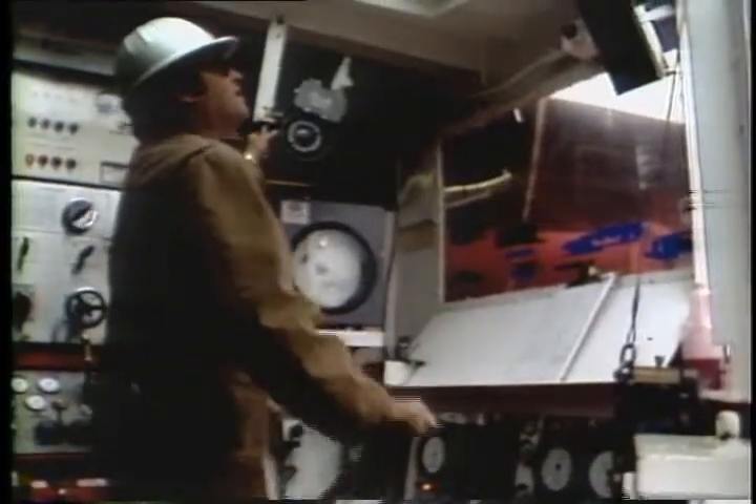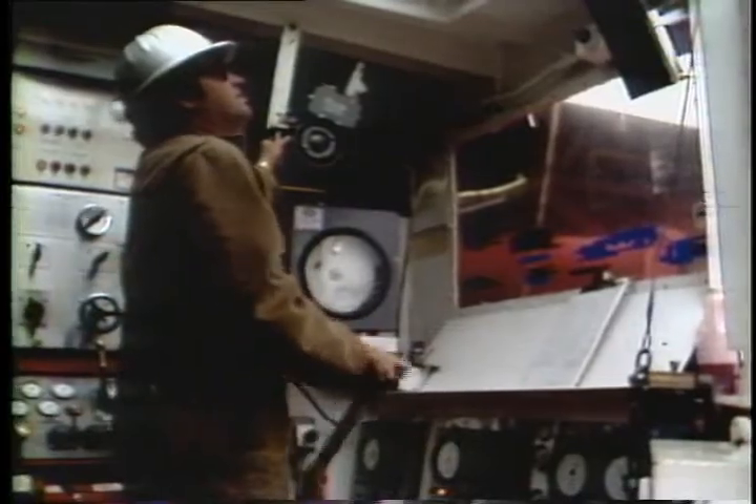Be sure your logging unit is monitoring gas sensors and flow returns. This process should be followed whenever you're trying to divert a kick. It's important that you have a plan worked out ahead of time so that everyone is ready to do their job.